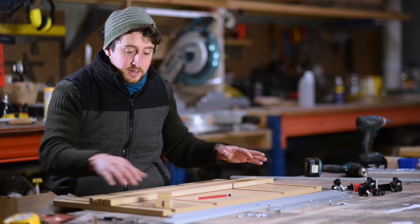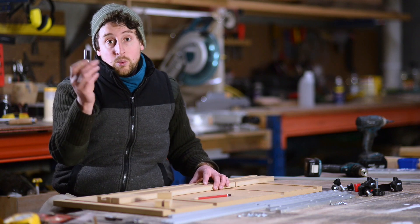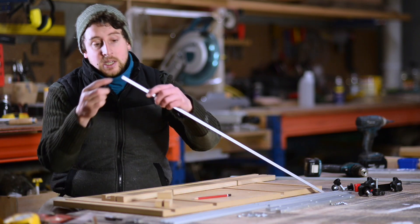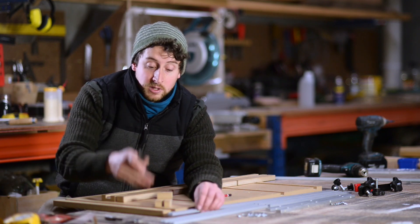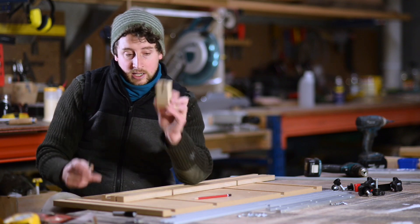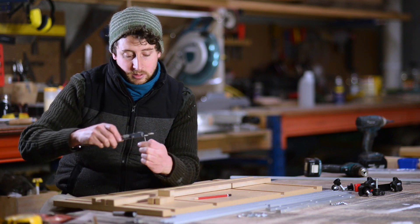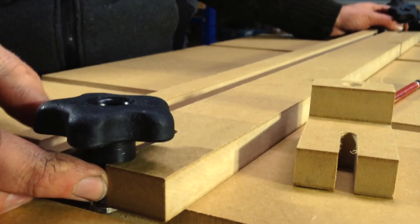In order to do the cutouts in your piece of MDF you're going to need a couple of router bits. The easiest way I found to do this was to use a 19 mil straight router bit for my channels — you just need to set the depth so that the T-Track sits perfectly inside the board, and a 19 mil bit will give you the correct width. To cut out the little channels in my stop and on my fence I used an 8 mil straight bit, and that perfectly fits those T-Track bolts.